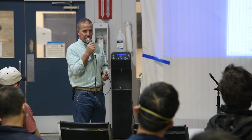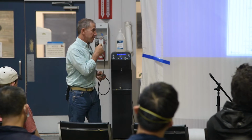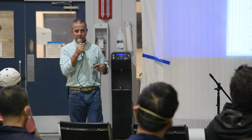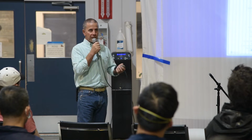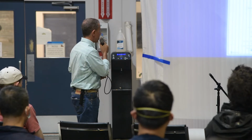This is that galvanic series again. A good idea to understand this, and Dan, I don't know if you guys ever post something like that, but it may not be a bad idea, just so you can get a feel for how far apart the different metals are on the galvanic series. Remember, the further apart they are, if they're in contact with each other, the more likely they are to cause corrosion. Stainless and aluminum, we live with it because we can't really avoid it, but other combinations we try to avoid.